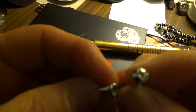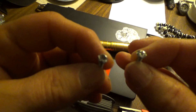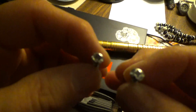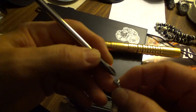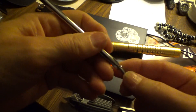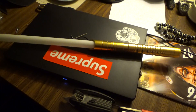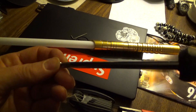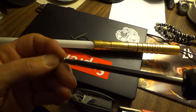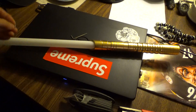This screw on the left has been stripped. These two screws were identical until I stripped one. What happened is I had the screwdriver in the screw tip, but as I was turning it, it kept slipping out — slipping and slipping — and eventually it wore out the threads until it pretty much slipped on every turn. Now it kind of spins in the hole so you can't get a good grip on it and it won't go in or out.